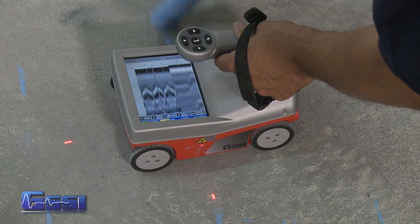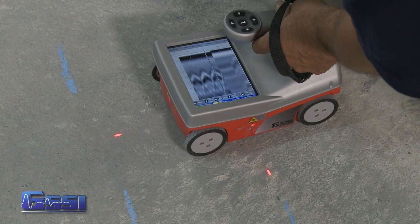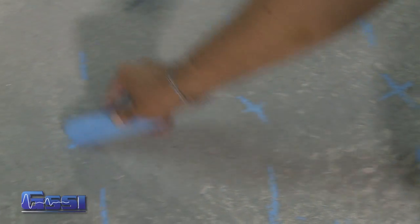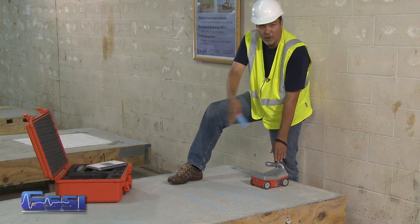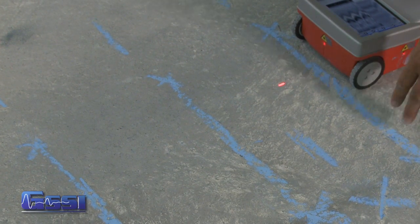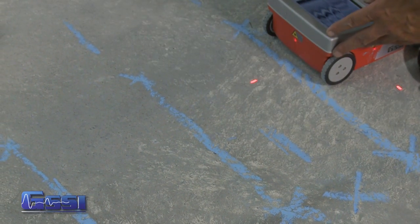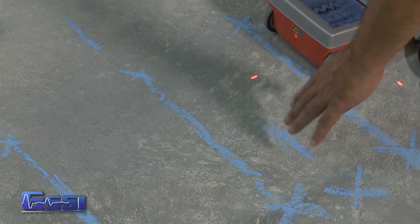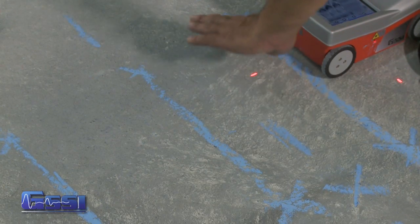I continue that process throughout, placing the X in between the lines I have drawn and eventually connecting the X's. I have now mapped out where rebars or any targets travel this way. In this particular case, when I scanned over here, this PVC did not show up, so it probably either ended or took a turn. I can't determine that until I do more scans, so that's why I'm not connecting any lines through here.